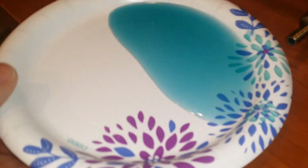If you look in there, I can see there's like two. It's kind of hard to focus in on it. Yeah, right there. That's water. So you can see there's still a little bit of water in the system. I can let this run for a half hour or so, but that's a good way to check the quality of your oil, how it's going. I will dump this. I'm not going to do it now because I'm holding the camera. I will dump this oil back into my jar and reuse it because it gets filtered.